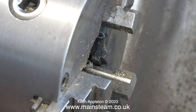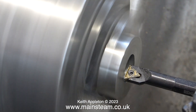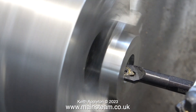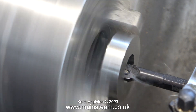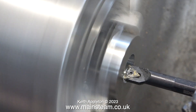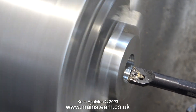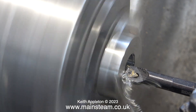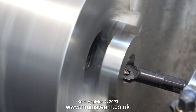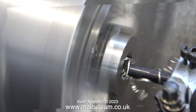The first one was easy — I only had to machine one side — but on the others I have to machine both sides, and the only correct datum I have to go by is the hole in the center. This episode may be misleading, but in the next episode all will be revealed. I'm machining these parts but leaving them oversize; I will need to remove a lot more material to obtain the finished items.